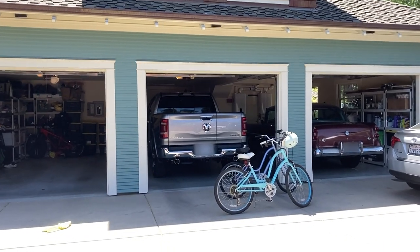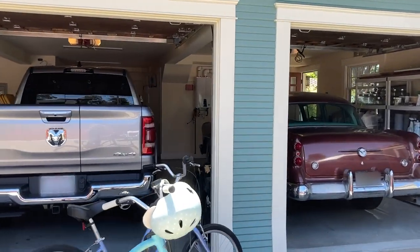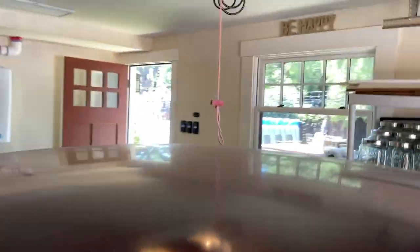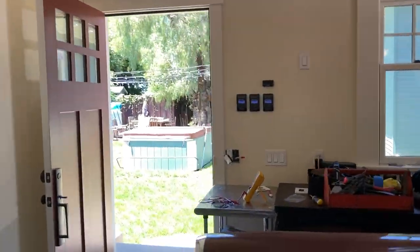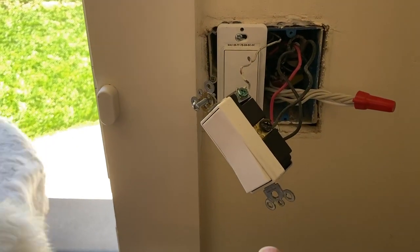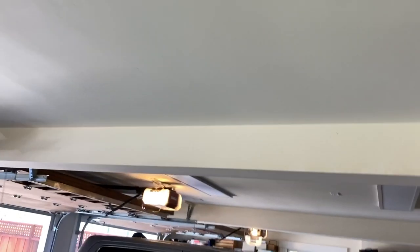I've been an embedded firmware engineer for 30 years and spent the last five years working on a globally shipped IoT consumer device, so I have a feel for how these things are designed. It seemed much more logical that the Wi-Fi electronics would take power from the traveler screws — whichever one is on, since one traveler is always on in both boxes — possibly with a capacitor to float over any switching transitions. That would guarantee the Wi-Fi is always on. So I decided to go down to Jordy's house and run some tests.